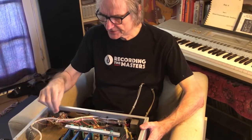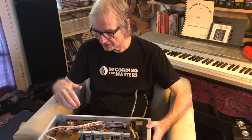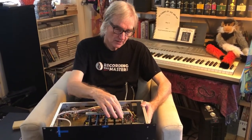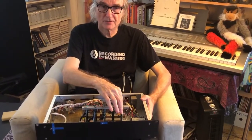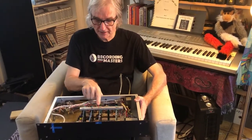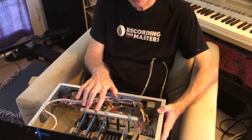This took quite a bit of work — it's more than it looks like. We have extensive wiring from the D-subs to the circuit board which contains the summing resistors, and likewise we have this little circuit card that handles the summing for bus three. So there we go: bus three, bus one, and bus two.